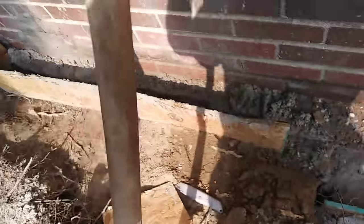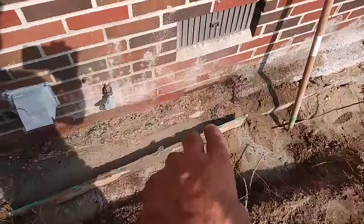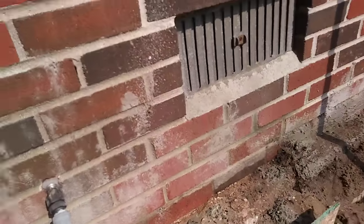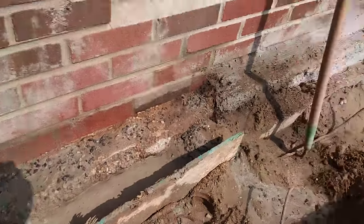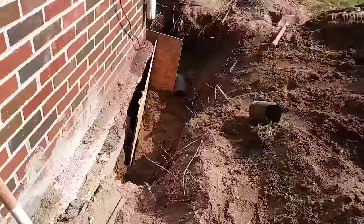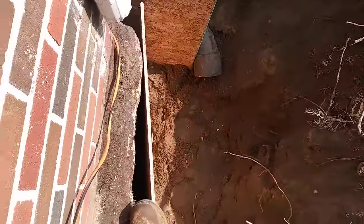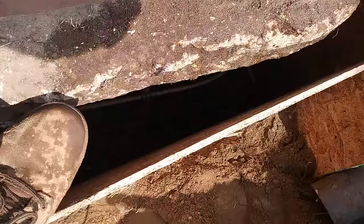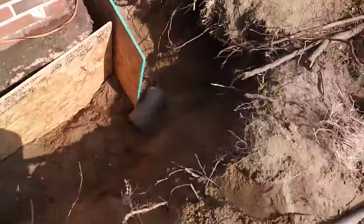Back to the finished version — we did four foot, skipped four, then four foot. Today we excavated and poured this four-foot section. It doesn't have to be perfect, but you want a continuous solid pour all the way across, each section butting and connecting to the other through rebar. The easiest way to do this: place your boards as shown, backfill a little, go to the depth of the footing, then bend your board out to fill it, tamping and slurrying as you go.